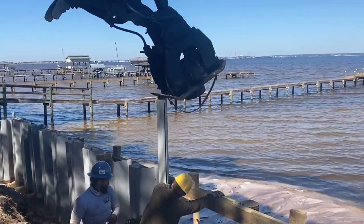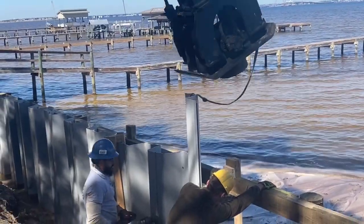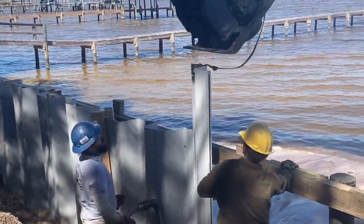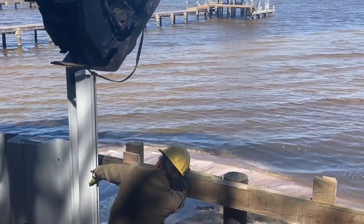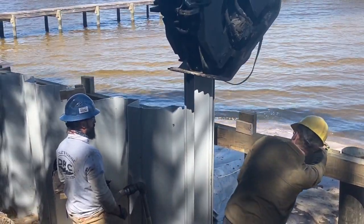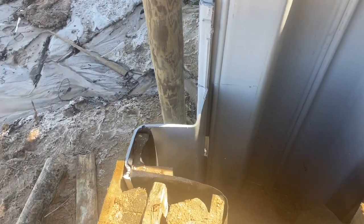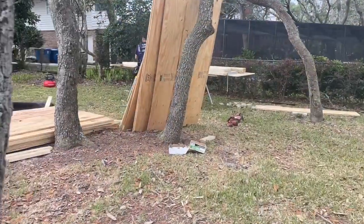I like to leave a little bit of the sheet up because we're doing a concrete top cap on this project. I like to leave the vinyl inside of the concrete and run some rebar through that to tie it all together. This is a 20-foot return wall in between the two properties that prevents erosion in case the neighbor's wall fails. You can see we've extended one sheet out so if the neighbor does decide to go with vinyl wall, he can connect in right here.